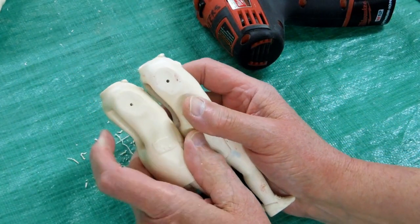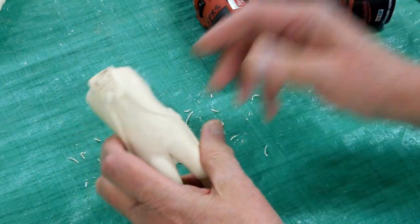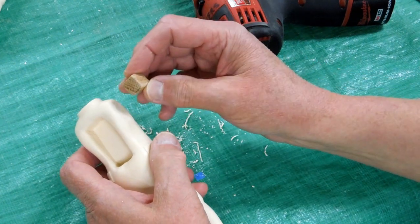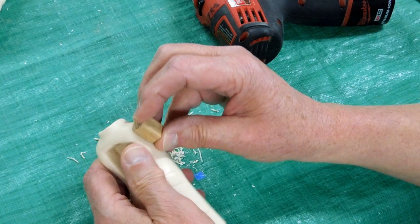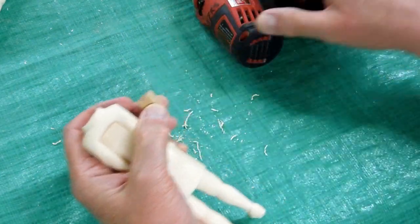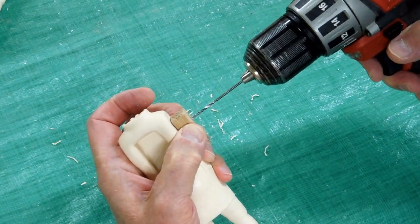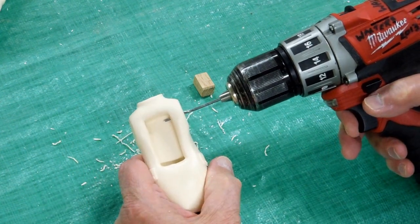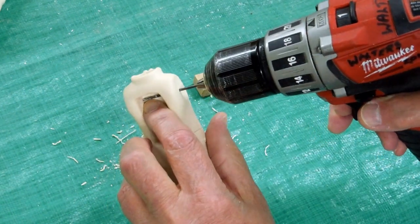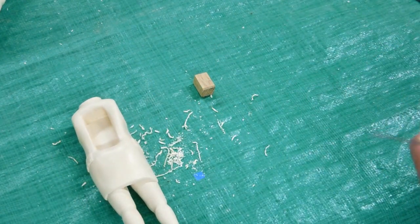See the hole — it's in the right position here, and it's in the right position here. Now if you don't feel comfortable drilling that at a right angle, get yourself a piece of aluminum or hardwood block that you know is square, go to a drill press and drill a hole in there. Then run your drill through that and use that wood block to keep you aligned when you start drilling this hole. Once you get through this first part, if it's not exactly right, you can bend it around a little bit until you get it lined up with the dimple on your casting. Then when we drill the larger hole through there, that will ream it out correctly.